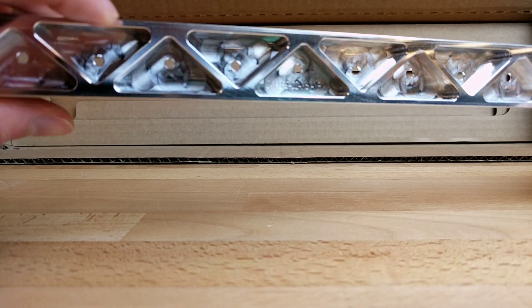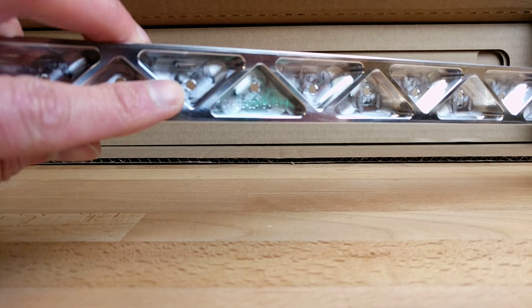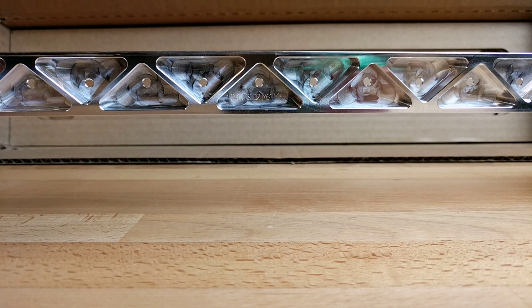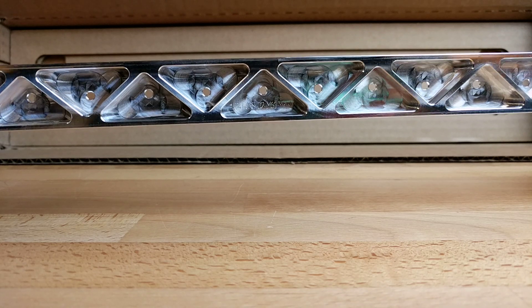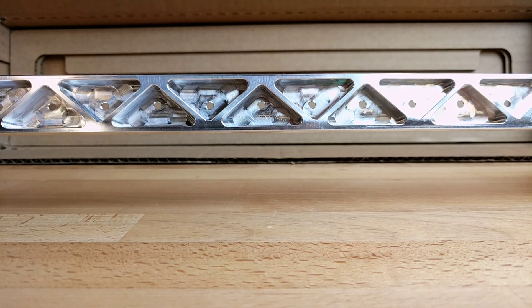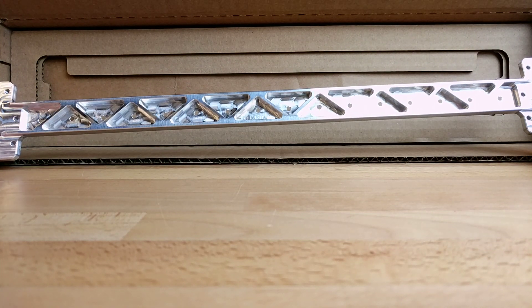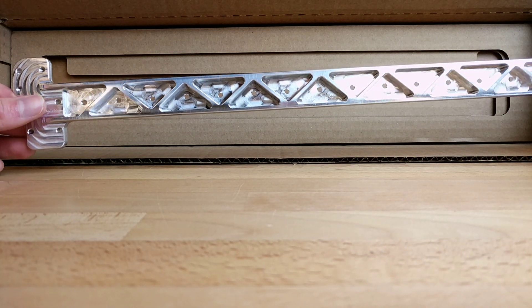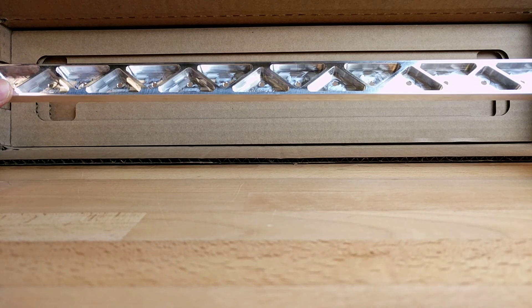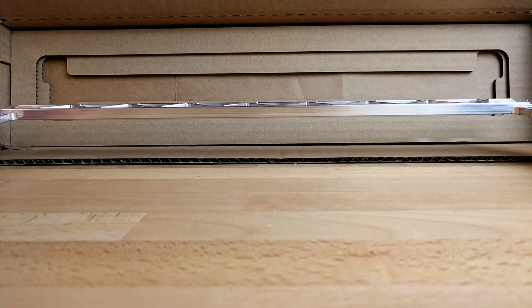One last thing I wanted to showcase is that our parts now have part numbers in some cases. This is a machined part example — it's a little bit tricky to see, but take my word for it that it's actually there. The idea is that we came up with a part numbering scheme, kind of between Discord and GitHub issues. I wanted people to really get a sense of what they have in their hands physically when they're building it. The project changes every once in a while, so I want to make sure that if we make changes to the main project on GitHub, you know what you have and what the differences are. The easiest way to do that is to embed part numbers — it's a matter of traceability and knowing what you have versus what's in the latest version of the project.